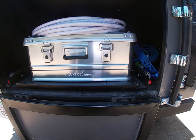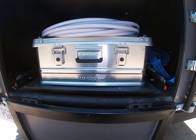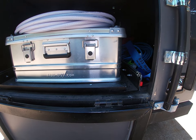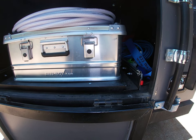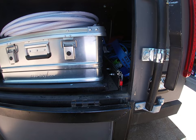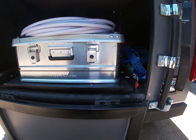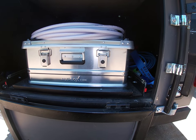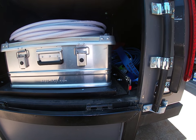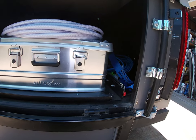In here I put together a drawer system — just a single drawer. I've got aluminum mounting it to the trailer and used steel on the drawer itself. It uses full-length drawer slides, about 48 inches long, so it can slide all the way out past the tailgate and holds about 700 pounds. I can't think of a time I'd overload that, but it does make getting into my gear a lot easier.